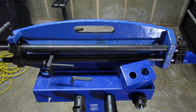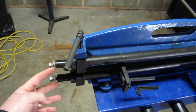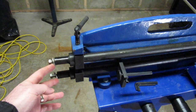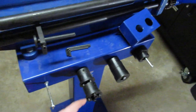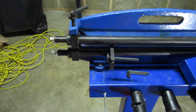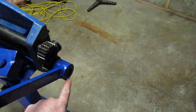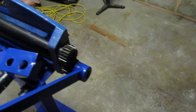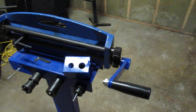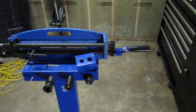As long as it doesn't affect my work, I'm okay with that. This has 22-millimeter shafts on this end, which is a pretty common import variety size, and they're 50-millimeter diameter components. The shafts are 50 millimeters apart. The end of the shaft where the crank attaches is 25 millimeters — and that's pretty important because Eastwood is now selling a motorized kit that you can put on these import bead rollers. It's about another 20 inches long, and I'm considering buying it pretty seriously.